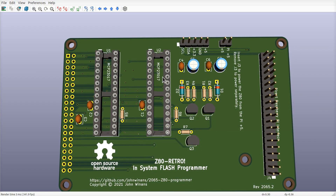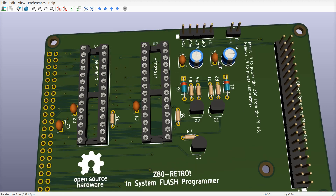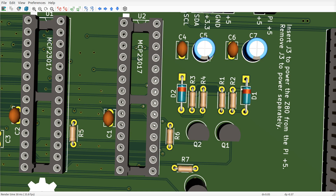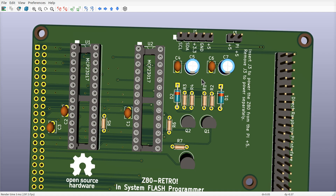What goes on here are these two MCP23017s — these are I²C to 16-bit GPIO parallel port adapters. All the parts over here are maybe a dollar all-in. These capacitors are probably not even needed; the electrolytics C5 and C7 I put on there because I had them on my prototype. I'm pretty sure it'll run without them, so if you don't have any, don't even bother. You do definitely want to have the bypass caps as usual.